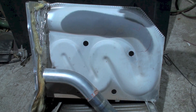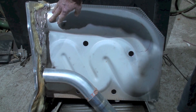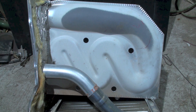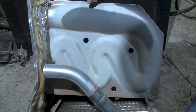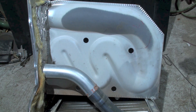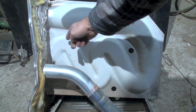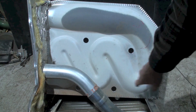Here we're looking at the side of the primary heat exchanger. The burner shoots in here, the gas comes through — you can see some discoloration because it's very hot. As the gas comes through, air passes over the heat exchanger and picks up the heat, so the gas starts cooling. You can see it's kind of a tortuous path. This is a clamshell heat exchanger, because two pieces are put together.